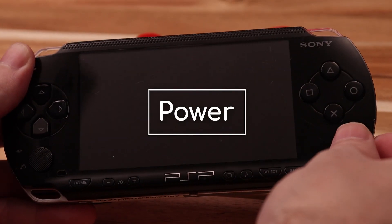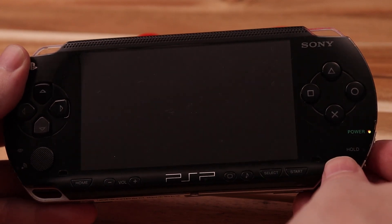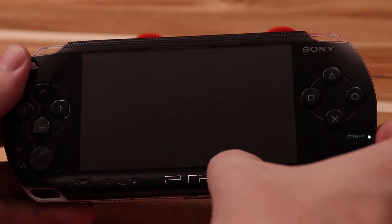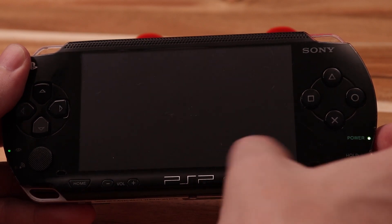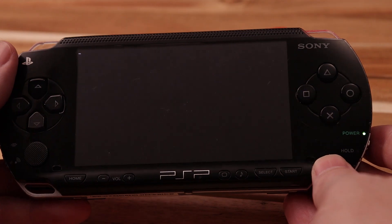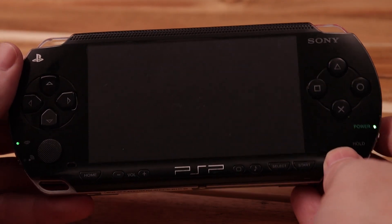Let's start with power. Like the previous board it's got a soft on/off feature where a quick press of the power button will turn the board on. Once you turn it on it'll give you two blinks on the power LED just to let you know that the microcontroller is working. That microcontroller handles all the input for the buttons, joystick, brightness, battery, and sends it all to the Raspberry Pi.